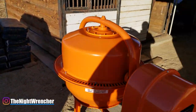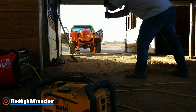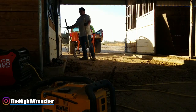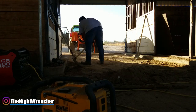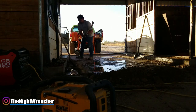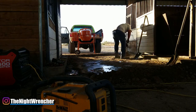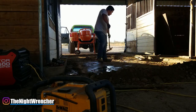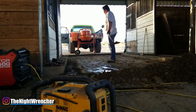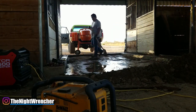All right, let's get to work. The only thing I'm doing here is getting everything nice and level, cleaning everything up, making sure I'm not going to have any hiccups. I'm trying to level it out as best as I can so I don't have any thin spots in the concrete, to prevent cracking or distortion while I'm laying it down. This is going to be more of an oil change pad — I'm going to be parking my cars here for oil changes, at least until I get a lift up. I do want somewhere I can do oil changes without worrying about keeping the concrete clean.